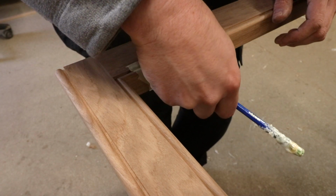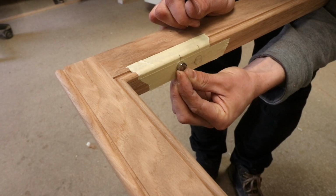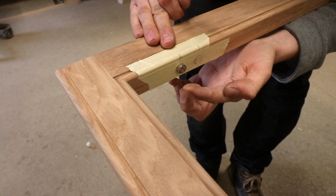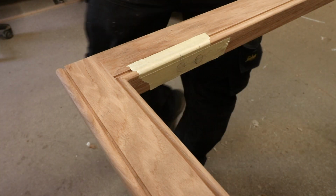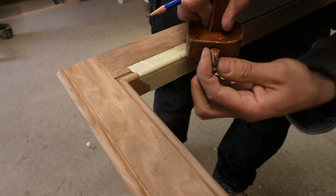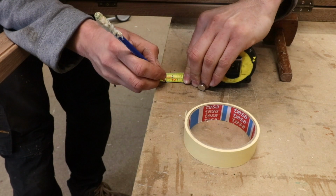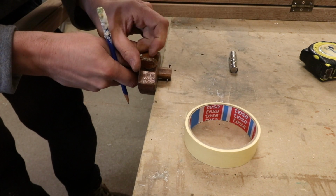So when that magnet's set in the door, it wants to be about 4 mil offset, so somewhere there in the flush position. So when them 2 pieces of timber are flush, we've got that bit of pull on the magnet. Don't drop them because they smash. If I'm drilling these in, I just set up a marking gauge to the centre, then I'll mark that on something and just bring it back 4 mil. To make sure that we've got that offset.